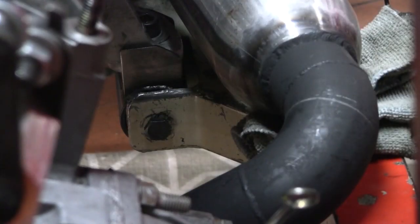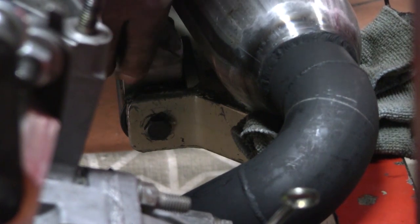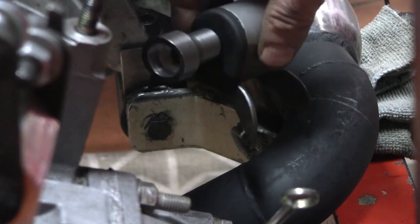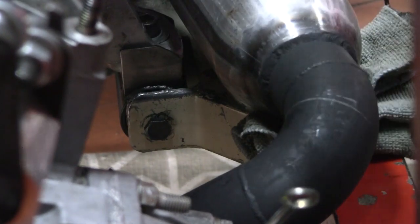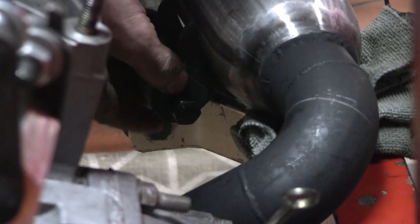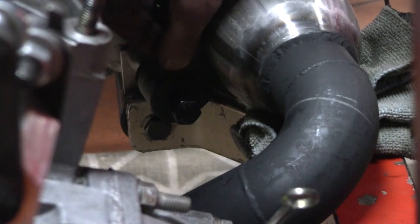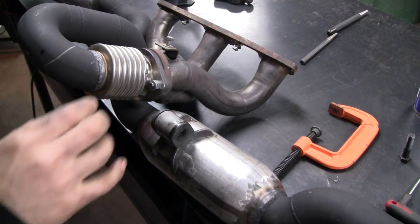And this was the real problem child. Really the only thing I could use to get a mount off the engine was my engine mount foot that I'd previously fabricated. So we've got another one of our little spidery units, and on this end, a little machined boss with a 10 degree chamfer on it. And that will go up against that little face of the engine mount, like that, and can weld it all up. Seems deceptively simple, but you have no idea how many safety beers it took to come up with that little arrangement. All tacked up, got it on the bench.